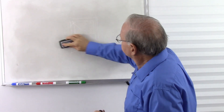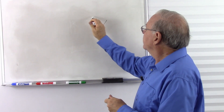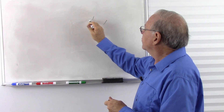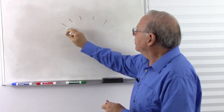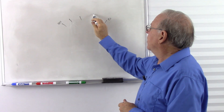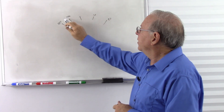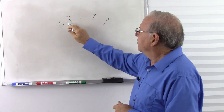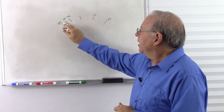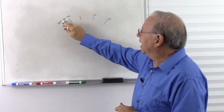Infinity is over on this side, and it uses a logarithmic scale. Let me give you an idea of what that means. So we have a scale that looks something like this — infinity over here, zero over here, and this might be about ten, and then maybe over here is a hundred, and then five hundred right about there, a thousand, two thousand, or one k.